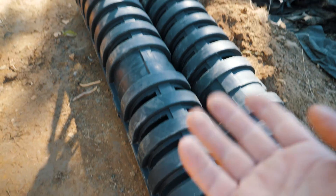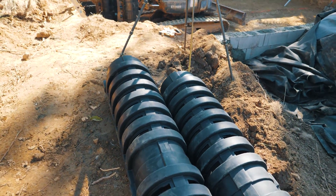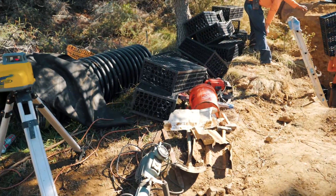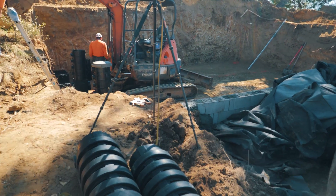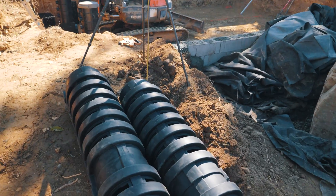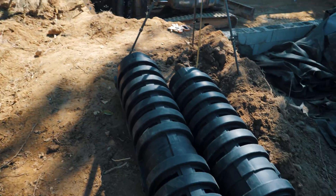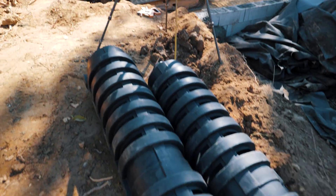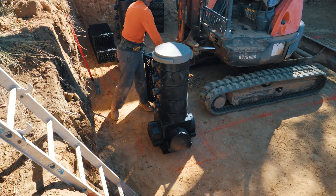It'll travel through here and come up through all these slots. There are gonna be multiple sections of this on each side, then it's gonna go up into that layer of aqua blocks. That's gonna slow the velocity down and give solids a chance to settle out. These are gonna be where clean-out ports are, so when the filter gets washed down through all the layers of gravel, it goes down through the aqua blocks and then down into the centipedes, over to where our snorkel module is, where we can have a clean-out pump ejecting all that dirty stuff.